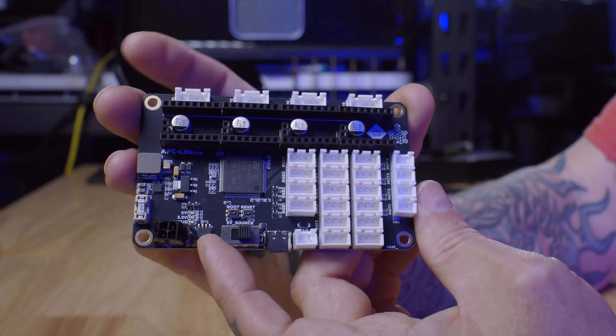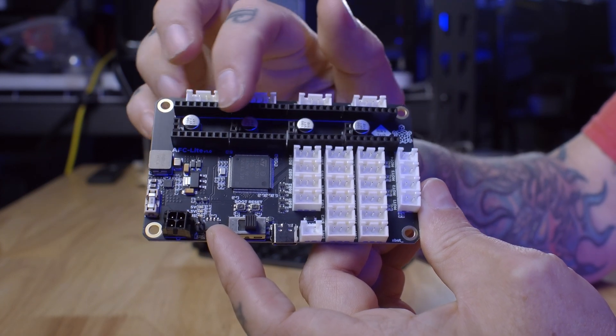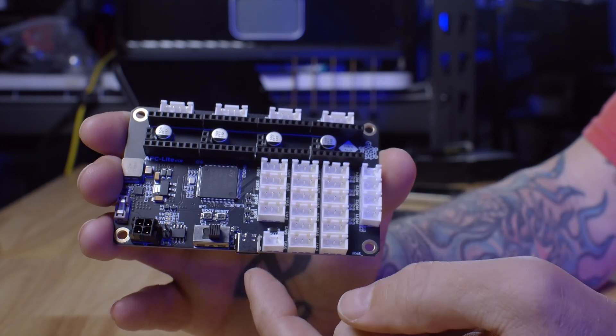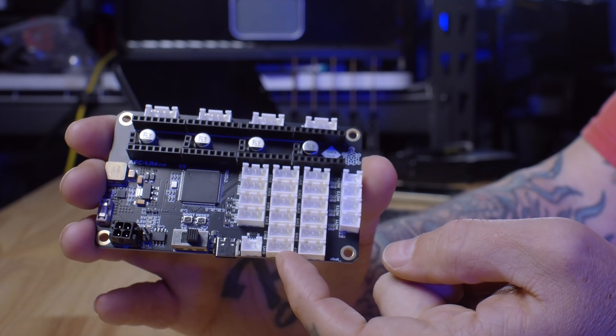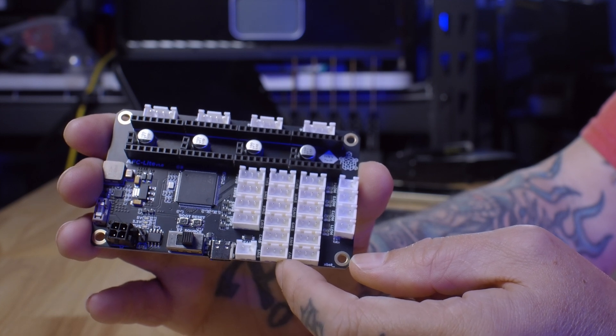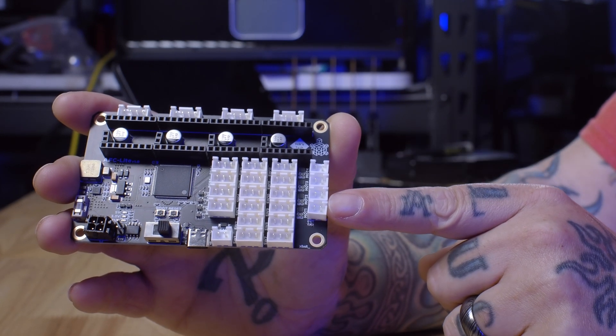The Box Turtle has four extruders, so here are the ports for the extruder motors. This is where the 2209s to drive those will plug in. There are four RGB LED ports, a cooling fan port, and 12 filament sensor switch inputs. This design uses a number of switch inputs so that it can tell where the filament is. Then there are these outputs for the re-spooler motors. There are a number of components that you build multiple times because there are four lanes of filament, so you need to build four re-spoolers and four extruders and so on.